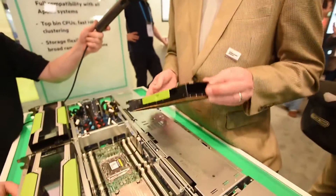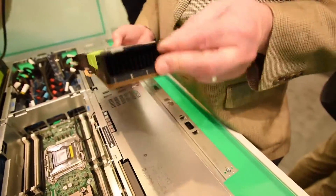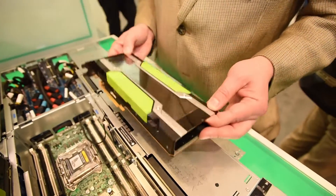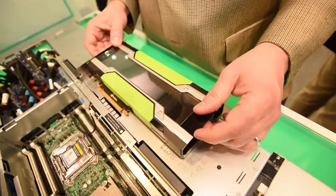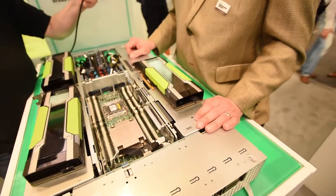Some folks say, Greg, how do you cool those? These are putting out like 300 watts a piece. Yeah, eight of these at 300 watts a piece is like two and a half kilowatts in a 2U tray. Add in the system memory and CPU, you're at about 3.2 kilowatts in a 2U tray. But we designed this to handle hotter.